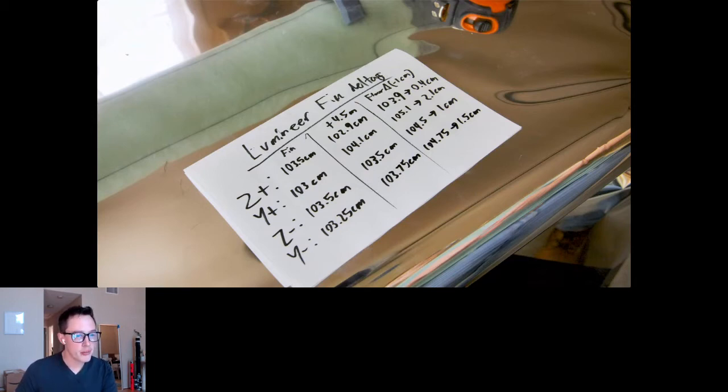Lauren asks: can you repeat what you mean by overstable? What I mean is the fins are actually too big for the vehicle. You shoot for a stability caliber as a rough rule of thumb between one and two. Something more stable than that will be more susceptible to weather cocking — tilting into the wind. And it also has the chance to go stable in scenarios where you don't want it to be stable — which, stay tuned.